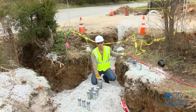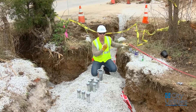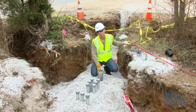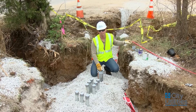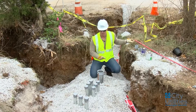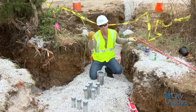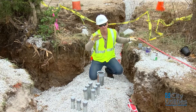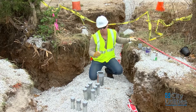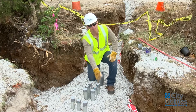This particular four-inch right here is actually coming from the riser that is directly behind me. It's already been bolted to the pole and this riser coming through the ground — what we would call a 24-inch radius sweep, galvanized, four-inch — this is where the primary feed is going to be coming into the junction cabinet. Inside this junction cabinet, it will be attached to some bushings along the backside, and from there those go back down into future feeds coming out. So we have our feed system coming in, and we've got three that's going to be going back out.